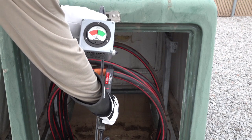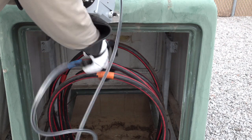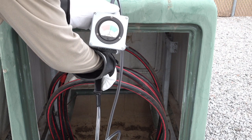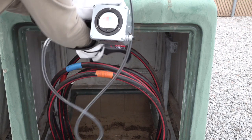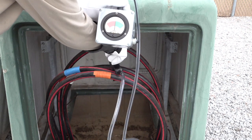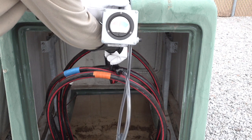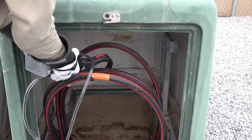From our near end red and black DCI-100 conductor connections, the red conductor is attached to the primary conductor with blue tape, so the needle should indicate a green deflection. The black conductor is attached to the primary conductor with white tape, so the needle should indicate a red deflection. All other cables — energized or de-energized — should indicate no deflection in either direction.